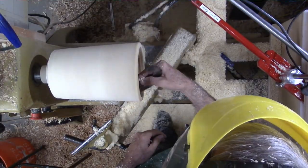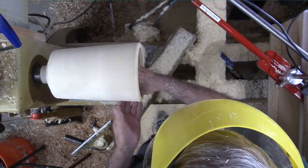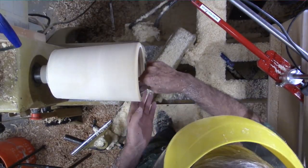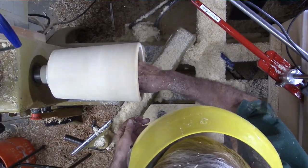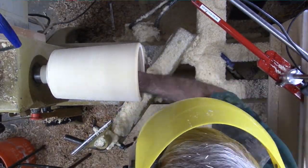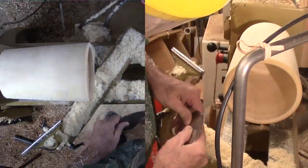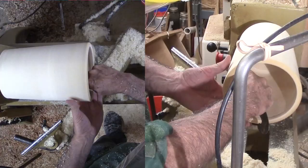The inside of the lampshade is rough from the stringy aspen. The cutter cannot leave a smooth surface on the wet aspen. Instead, I try a curved cabinet scraper. After all, the hollow is big enough for my hand and the scraper. But you should probably not consider this a safe maneuver, but it does clean up the inside.